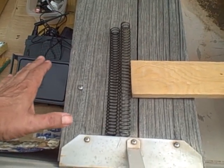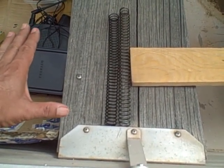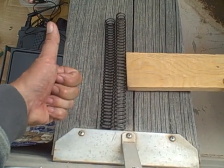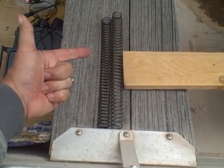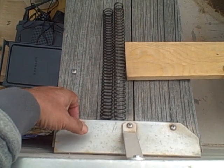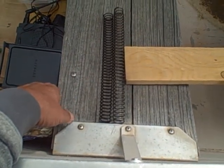I built the thing primarily with off-the-shelf stuff, and that included an off-the-shelf rear buffer kit that I got — it's an ATI kit. So it had the pistol-length tube, the carbine-length spring, and the 2.9 ounce buffer assembly itself. I thought because it was all coming from the same manufacturer as part of the same kit, that it would work right out of the box.